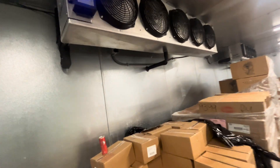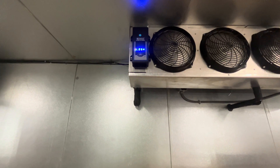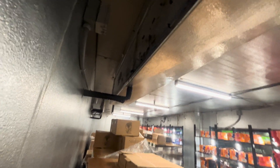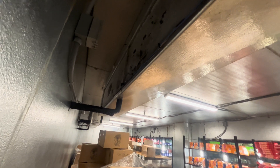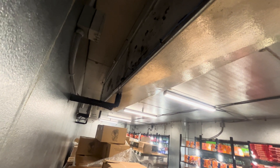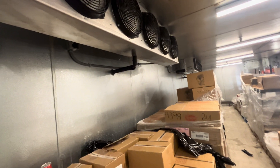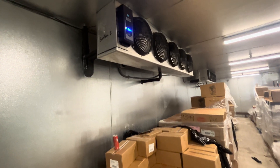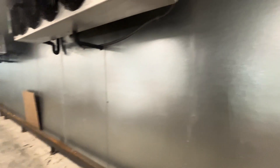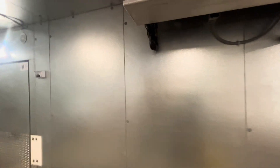So we're back today. All motors are working. But now I believe we've got a little superheat alarm. I don't know if it has anything to do with that little bit of ice that's still on the coil, but I'll get that off. Now we've got a little superheat alarm. I had a feeling there's something possibly going on with that EEV because this is the same system, same circuit, and it doesn't have that problem. Still no ice on the coil.